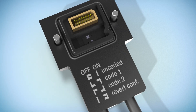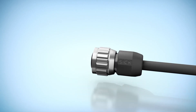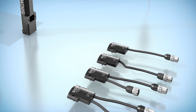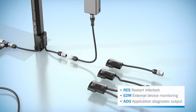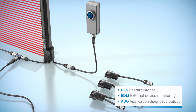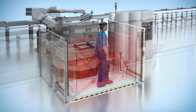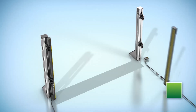This can be set for each individual sensor directly or on the main connector. M12 connectivity enables intelligent standardization — the device's full functionality is covered by just four system connectors, making the system incredibly easy to cascade and allowing for a reset push button to be connected. Up to three protective fields may be positioned adjacent to one another without blind zones, providing presence detection for example.